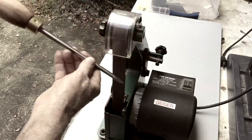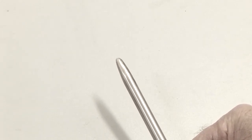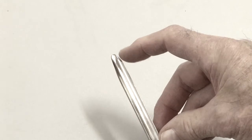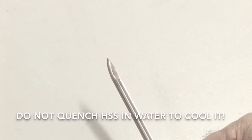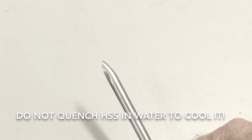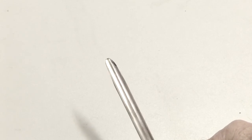It just gives it more of a polished look. Here's the final result — notice how the convex bevel is highly polished. That mostly came off the 80 grit wheel, but I touched it up a little bit with the one-inch belt sander. Notice there's a little bit of bluing in the flute on the edge — that's not going to hurt anything since this is high-speed steel. High-speed steel doesn't lose its temper until about 1100 degrees Fahrenheit, which I didn't get anywhere near, and bluing does not indicate you've ruined the temper as it does in carbon steel. Notice how nice and smooth the back is — whenever I go in and work with that back against the wood, it doesn't leave any damage. I hope this was of some help to you, thank you very much.